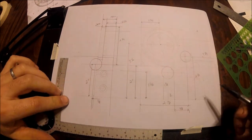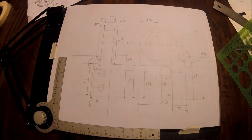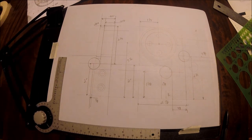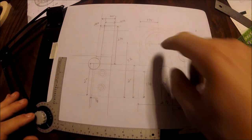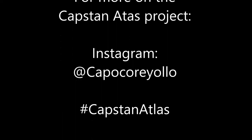So we need a 0.9-inch thick block, four and three-quarters by two and seven-eighths. Put the big bore in the middle and go from there. All right, now we're finished — I'm going to the shop and we're going to get to work. Thanks for watching and stay tuned to see how this works out. Once we bore the hole we can make the stop, get it mounted, and after that's done it'll actually start looking like something up there. See you soon.